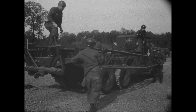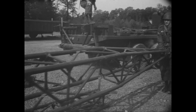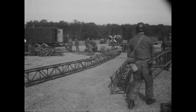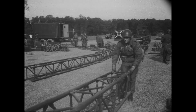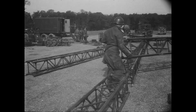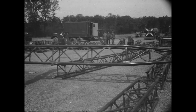Servicing section personnel next unloaded and assembled the lightweight H-Frame and A-Frame equipment. The H-Frame and A-Frame equipment was transported on the bed of the two-and-a-half-ton erector servicer truck. The use of the H-Frame created the proper alignment and distance between the launcher and the 10-ton capacity winch located on the bed of the erector servicer truck.